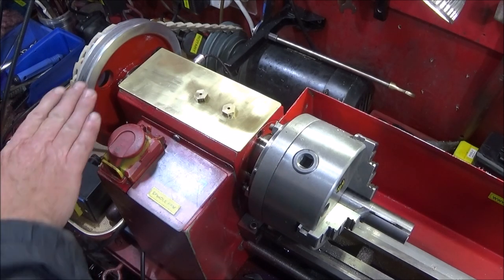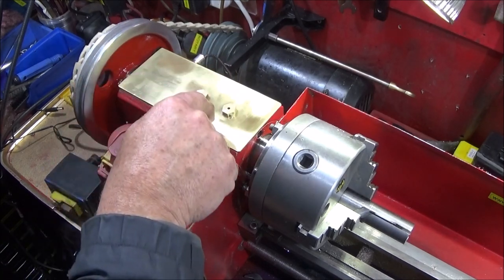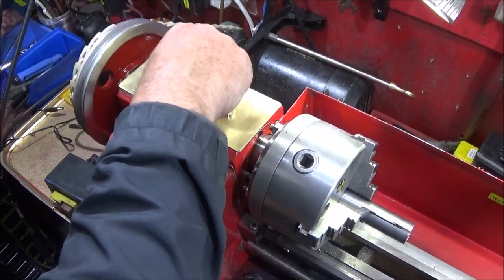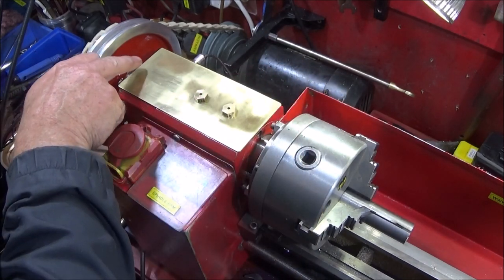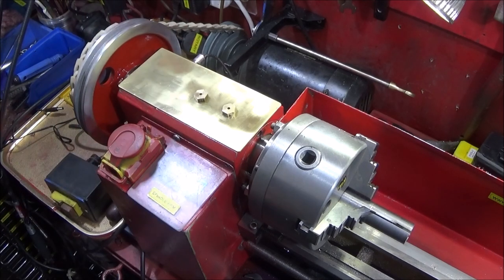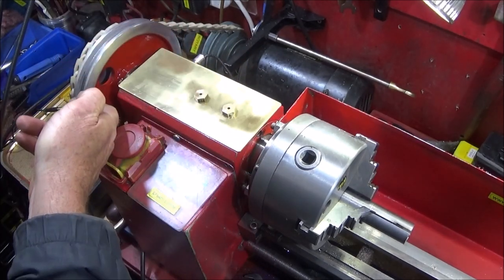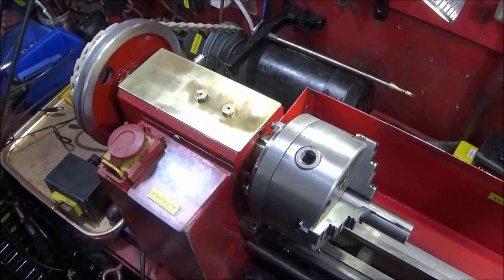It's all starting to look pretty impressive. I've secured a brass plate to the top of the headstock using the 1/8th BSP threaded holes that previously held oilers for the gears — since I no longer have those gears, I've used slightly longer bolts to lock the brass plate solid. On the back end I'm going to mount the pin assembly for a 24-hole indexer, using a six-inch, six millimeter thick mild steel round plate from eBay. Once I get the three-phase motor and inverter, I hope to try that out in various modes.